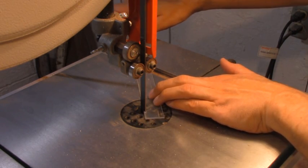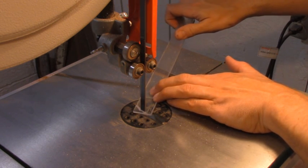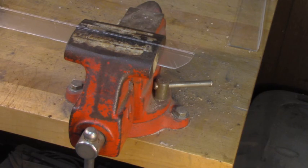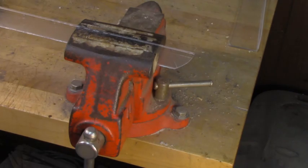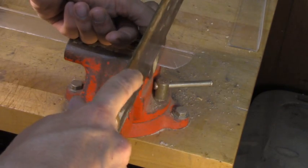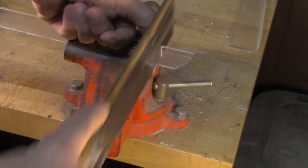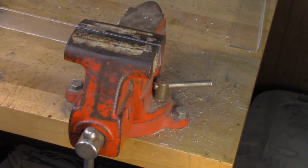The bandsaw is probably my number one choice for cutting curves or doing really quick cuts where I can't be bothered to get out the table saw. You can also cut acrylic surprisingly well using hand tools. If I had to trim a small piece like this and didn't feel like turning on a power saw, I'd grab a small fine tooth back saw like this one and just cut right through it. The quality of the cut's not bad, and I didn't have to turn on a machine.